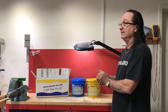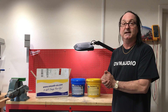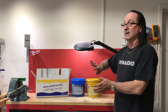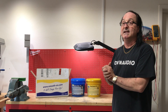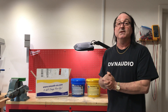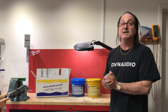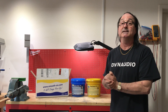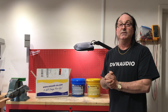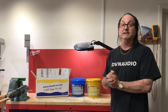For application, you make an appropriate mold and spray it with a release agent, then subsequently apply the epoxy onto your form. It can be anywhere from about three-eighths of an inch thick up to an inch thick. The working time of the epoxy dough is more than an hour, so it gives you plenty of time to make your shape exactly the way you need it to be. The epoxy dough can be smoothed by dabbing your finger in a little bit of water and smoothing it out.